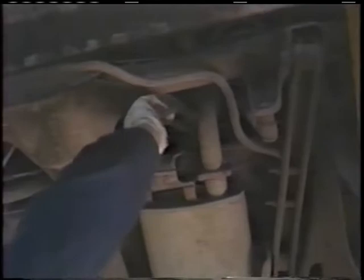One other thing you might want to check is the routing of the tailpipe, making sure where that goes that it needs to miss the gas tank. And you see that it moves inward so it misses the swing arm up here, and then it comes out and it misses the tire. And then it has to go outboard outside the frame and roll with the quarter panel so that it meets the hanger back by the bumper.